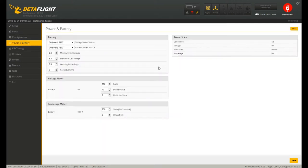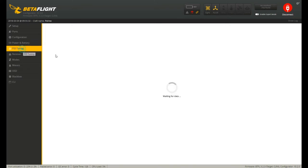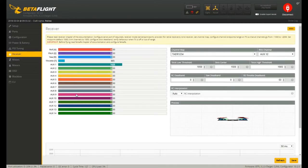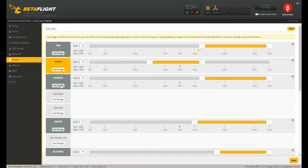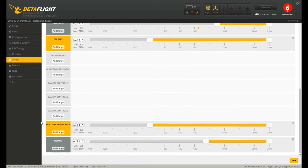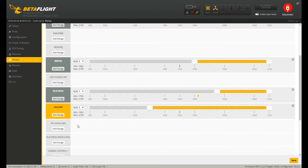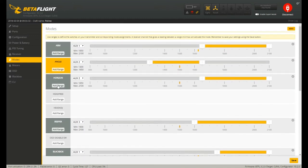The battery voltage indicator worked straight out of the box — I didn't need to change any of that, it just literally worked, and I didn't have to do any measurements. The PIDs are currently exactly as they come out of the box with no changes. Receivers are all set up. My usual mode switches are configured: arm with a pre-arm, turtle mode enabled, failsafe on one of my buttons, and a mode to switch between angle, horizon, and full acro.